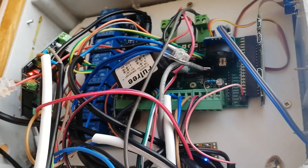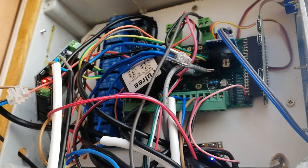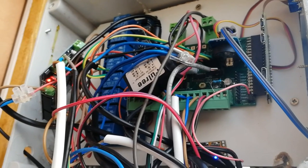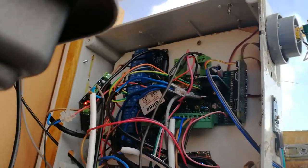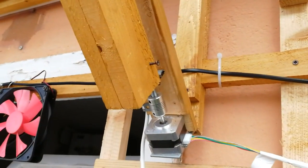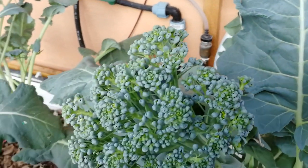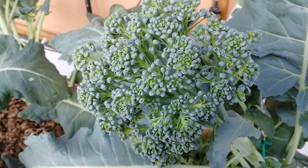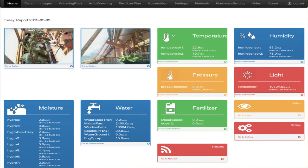The system can automatically control all the aspects of this greenhouse: the fan, the valves for the sprinklers, the pump for the fertilizer, the camera, the sensors, the opening of the window — and everything is set by graphical interface, so no programming required. Next I also plan to add some lights for better growth. In the next videos I will address the software. The software is open source — you can find the GitHub repository in the link — and it lets you set all the parameters for the automation of the indoor system.